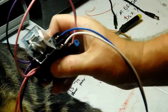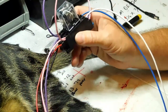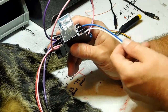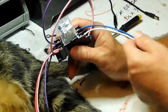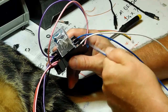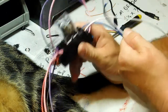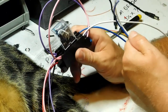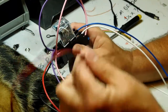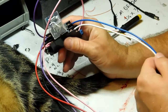The blue and white wires are output wires coming out of terminals nine and twelve - nine is negative, twelve is positive. These wires go to your amplifier, your radio, or whatever you're powering. This is what powers your boom box; the relay just determines what's going to power it. When the relay is off and you're running off the battery, everything comes through the black and red wire and comes out of the blue and white wire.